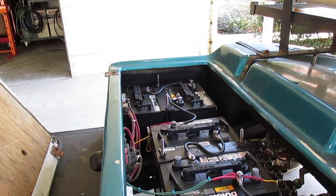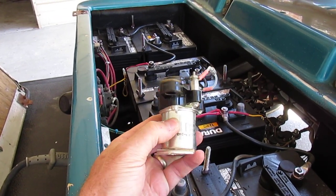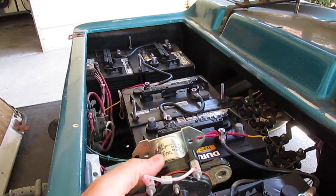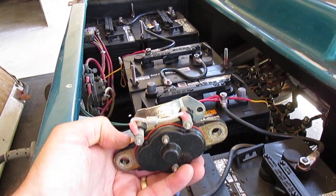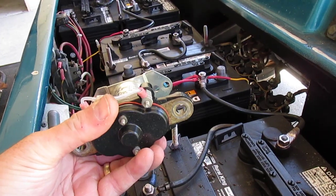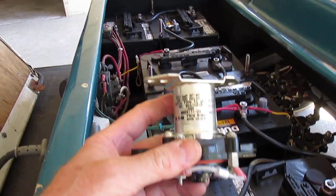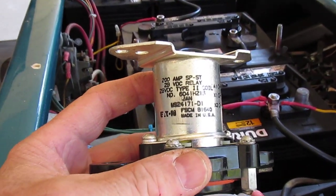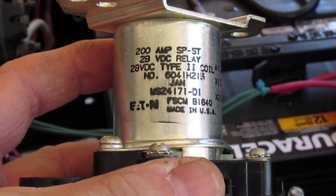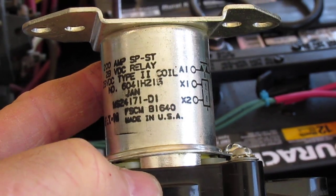I'm about to show you what I'm using now — it's this relay right here, made by Eaton. It's a normally open relay with two big wings where you attach your wiring, and the relay coil is on these two studs here. There's a diode suppressor that came with it that I'm not using. It's a 200-amp, 28-volt coil which seems to be working fine with 36 volts. I think I've seen these at Newark Electronics and some other online electronics suppliers.